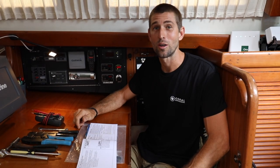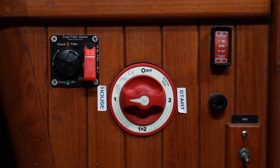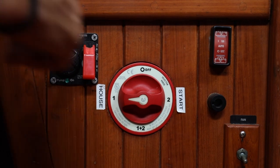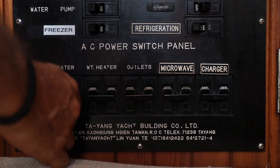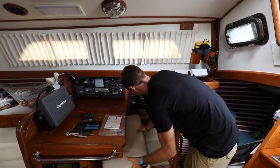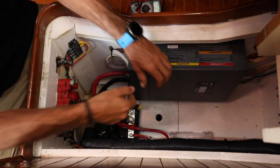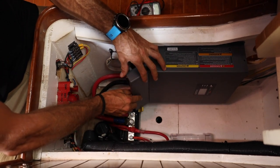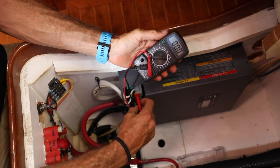The first step is to turn all the power off in the boat. Since the inverter charger is connected to both the DC and AC, we need to verify that everything is turned off. Every inverter installation needs a disconnect on the DC positive side, and this battery switch is it for us. Underneath this seat is where our inverter charger lives. Now that we've disconnected the power in the boat, we can go ahead and remove the case cover, double-check that we've killed all the power to the inverter charger, then disconnect the wiring and pull it out.